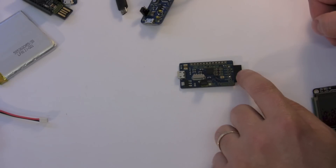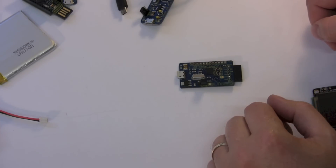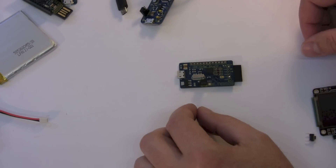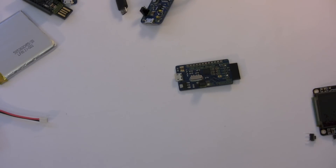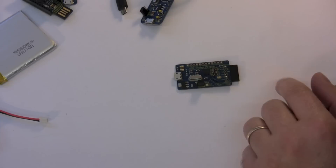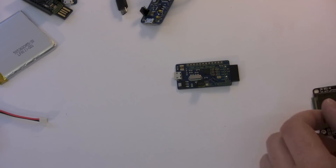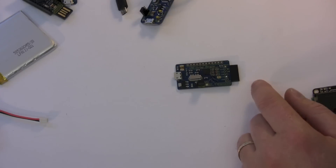This does a little bit more than just an FTDI cable. FTDI cables come in 3.3 volt and 5 volt versions and are basically a closed black box — all they do is USB to serial conversion. This is actually identical to the circuit on an Arduino Uno with the ATmega 16U2 sitting in the top left corner converting from USB to serial to talk to the main chip. So this presents itself to the Arduino IDE essentially as if it's an Arduino Uno on behalf of whatever you have plugged into it. You can use it for direct serial conversion or with the IDE.